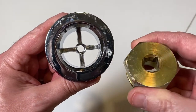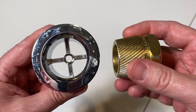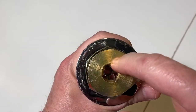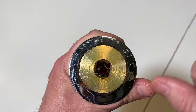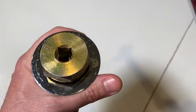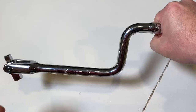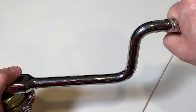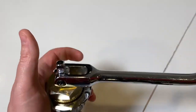That's where this inch-and-a-half tub extractor comes in — it's essentially just a really big easy-out. You just pop that in there. You're able to put a socket on it or a breaker bar. In my case, I tend to use this breaker bar right here — it's got a good bend in it with a handle. You just pop this on and it brings you up from the bottom of the tub a little bit, and you're able to just turn and pop that out.